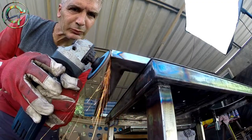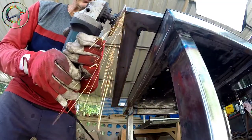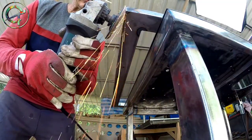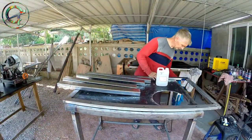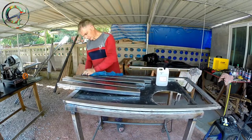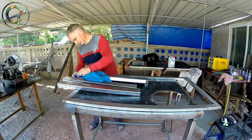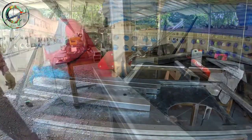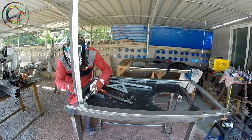Now and then while welding I still have sparks — not as many as before, however they are still there and that's not fine at all. The only problem I can think of is greasiness and dirtiness, so after the sanding I do one more clean pass with acetone. And here I am ready to assemble the table legs. This is the concept I have in mind: I'm going to weld the table legs with a 45-degree angle from the inner mainframe 90-degree corner.